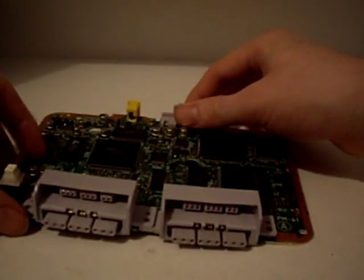It's the main board we're going to be working on, but we're going to put this to the back for now and we'll go program our PIC chip. So this is our PIC chip flashing program. As you can see down here, it says chip selector. We need to select our PIC chip, which is the 12C508A. And as you can see from this image here, we need to place the PIC chip in the programmer like that.